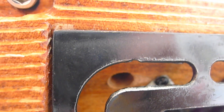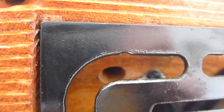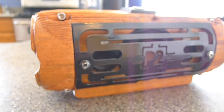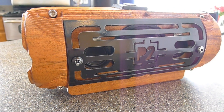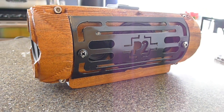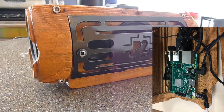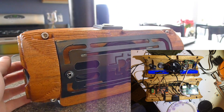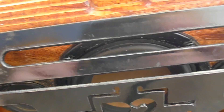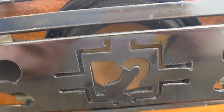That hole drilled right there may look like a mistake, but in actuality there's a microphone inside of that hole. At one point or another, this speaker was going to have the Alexa voice service inside of it by using a Raspberry Pi 3 as the computer for that. Unfortunately with everything else that I had to cram inside of here, and especially because of this massive 3-inch driver, I could not fit the Raspberry Pi inside of this.